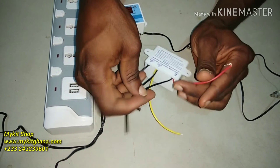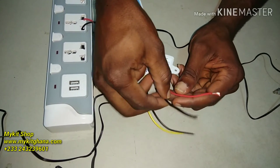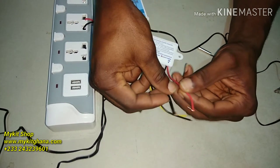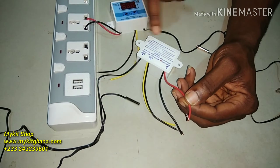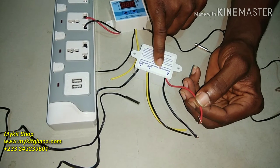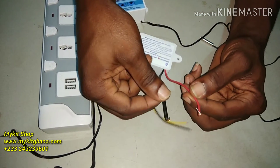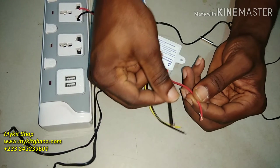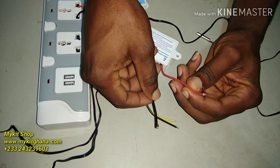The red is your live — the red is supposed to go to live. The IN terminals we are going to connect to our power supply, our power socket, which is 220 volts as marked on the unit. We are going to put the two IN cables to our power supply: the black will go to neutral and the red will go to live.